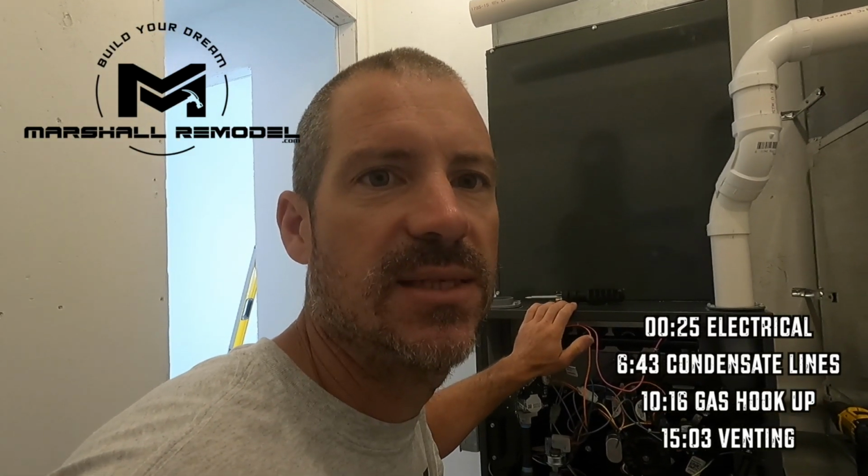So I turned the gas on downstairs. I'm going to go ahead and check for leaks. I use Dawn dishwater soap and water to look for leaks, and it's just an easy way for me to find them. You get really big bubbles if you have a gas leak, and they're easy to spot.